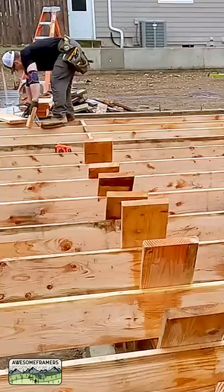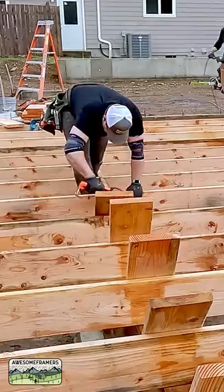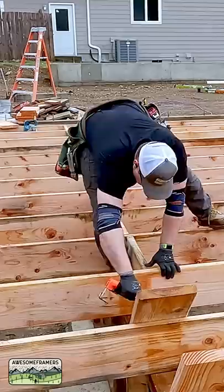The beauty of using up our 2x6 footing boards on the pony wall — well, one, we don't have to pack them around anymore, but two, I have a 2x6 wall that I get to walk while I'm blocking. So leave your joists unnailed over the pony wall; that way you can push the blocks in, but toenail them as you go.